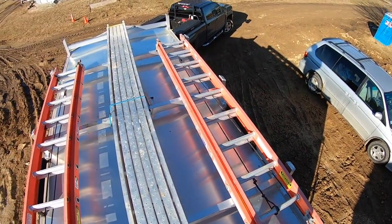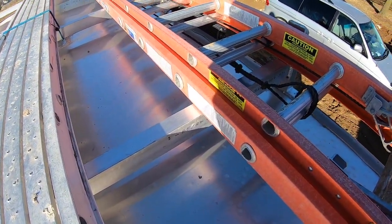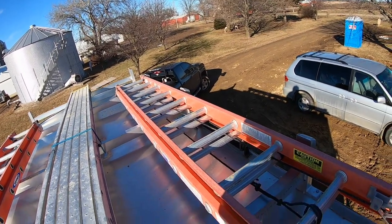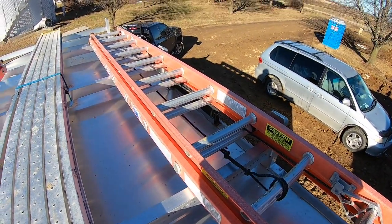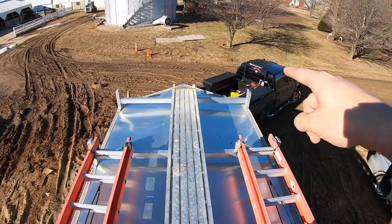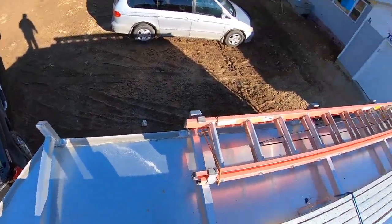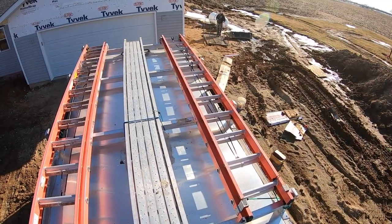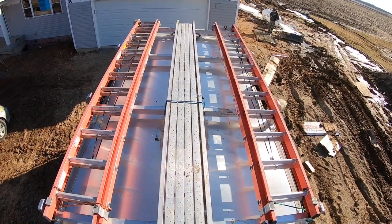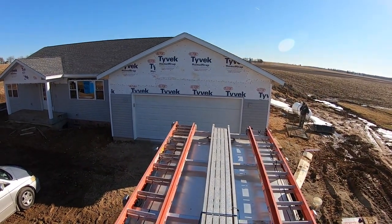Now I'm on top of the trailer. We have five nice members, all built out of two by three aluminum. He did some really cool-looking miters on them which actually match the back rack on the truck — it's the little things. We're eventually going to do a catwalk down the middle, and there will also be an up-and-over ladder that comes up on one side and connects in, with the catwalk going down and out. Right now this is the normal setup for running a plank and ladder jack — two 24s and a 16-foot plank, which we use for siding and stuff like that.